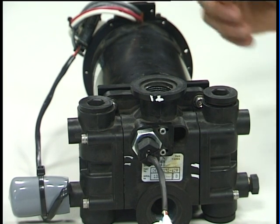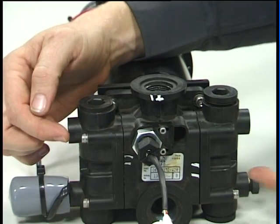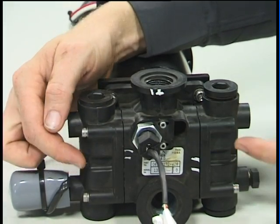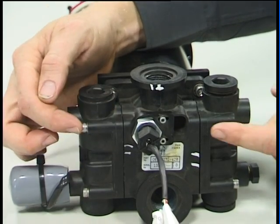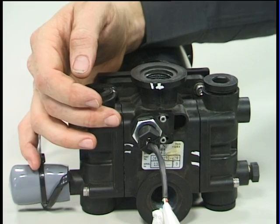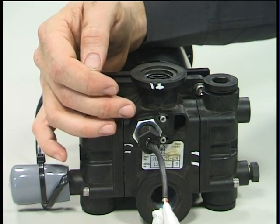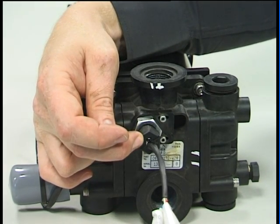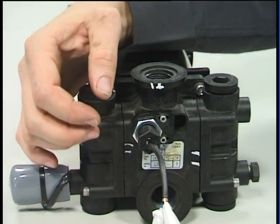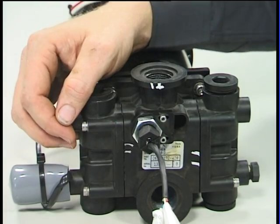The direct chemical injection pump has a flow sensor which picks up the chemical pressure leaving each pump element via a shuttle connected to a magnet passing the front of this sensor. When the magnet passes the front of the sensor, the red LED light in the rear of the sensor illuminates and indicates that the shuttle is moving backwards and forwards.